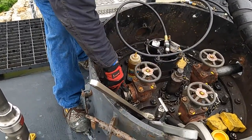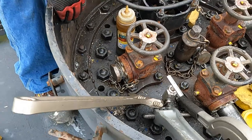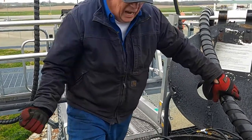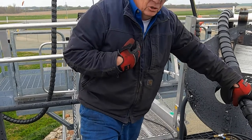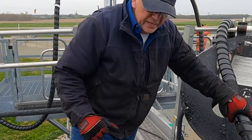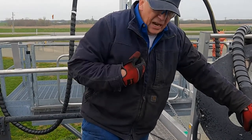You can tell here I only got just a little over two full threads. If you ever put a plug in and it bottoms out to where you've got one thread or less, you have to document that. You have to take a picture of it, and you have to forward that information up so they can address it. Because we're not allowed to replace the plugs — we're not allowed to replace this threaded flange. All we can do is document it, and that's how we protect ourselves.